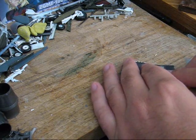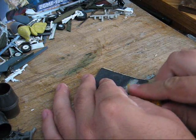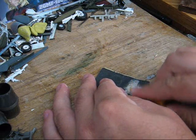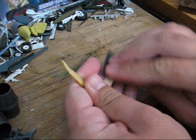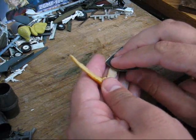You can also, for situations like this, do what I'm doing here: lay the sandpaper out, and instead of moving the sandpaper, move what you're trying to sand, as that can potentially be a little easier to do, depending on how the putty is cured up.